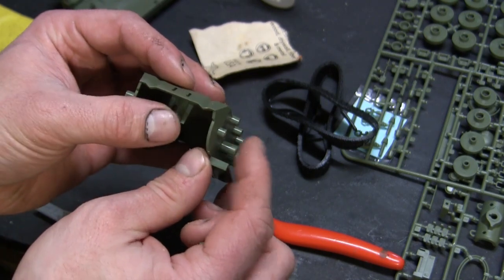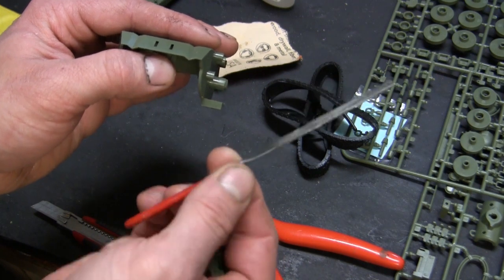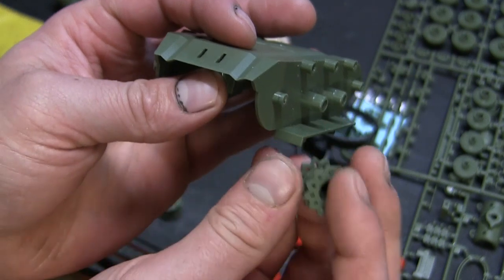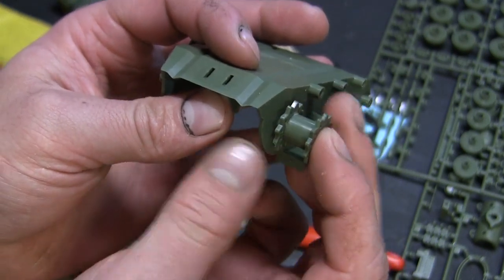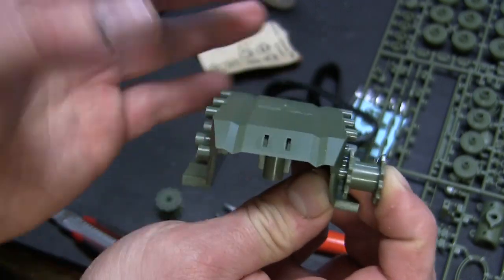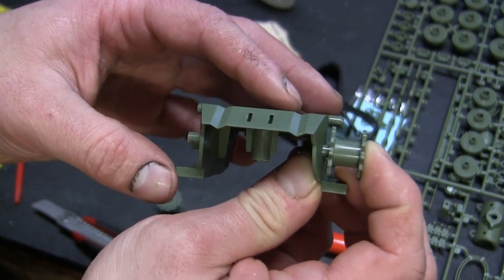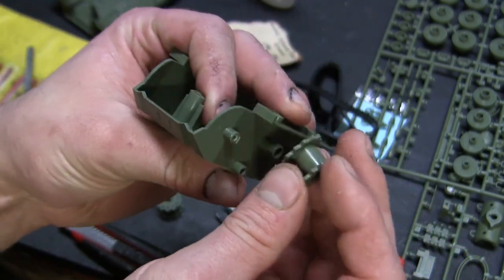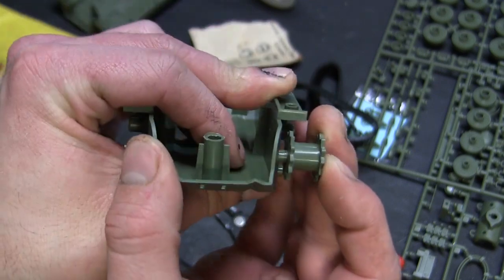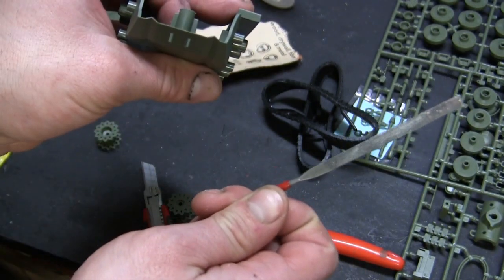However, even with the material removed, I just refined it slightly further with a few more passes of the needle file. Here you can see the line that I drew before. And now I'm just going to test fit the part on, and you'll see that it lines up perfectly with the line as it did when it was mounted in the other configuration. If I try the same technique on this side, as you can see I have a little bit more material to remove, and this is going to be done by hand with the needle file.